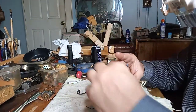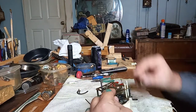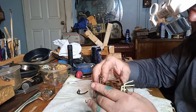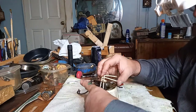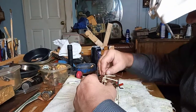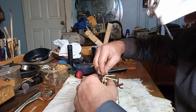Put these on after you put the plate on, because this nut post here stops it. Remember you've got to put the time-side great wheel in before anything else goes in. Once you can start some nuts, go ahead and start them, and once you get all four nuts on, you're almost done.